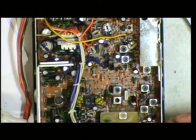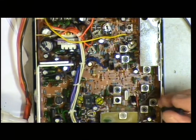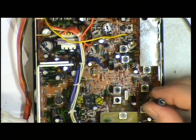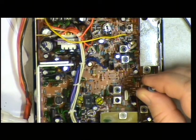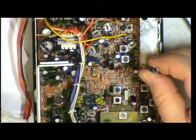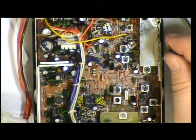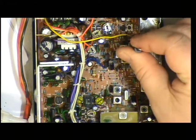From what I've worked out, L301 is our first transmit coil. I'll see if we can get a peak on that — which we can. Next is L210. Straight off the shelf it's doing 2.7 watts. Let's force it up a bit — L209, L208, I presume that's one in there — that's not making much difference. The power set control is RV103, which is the preset just there, and that was actually on full.